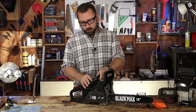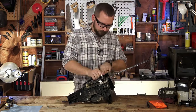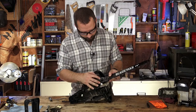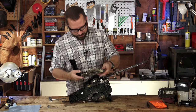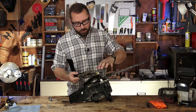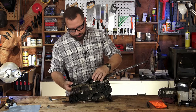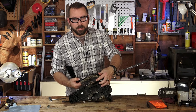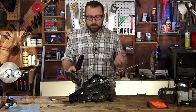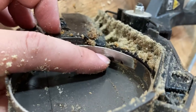I have found a potential fix for this though. First I'm going to take this cover off here. Any chainsaw you use is going to end up gunked up in here, and the inside of the chain brake is going to end up gunked up as well. I have been able to fix the issue or at least make it better by cleaning out this area, because unfortunately the chain brake is so tight that it doesn't have a lot of room for any sort of gunk reducing the clearance. And you can see this worn area right here from when it's catching too much.